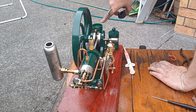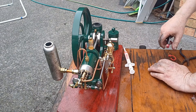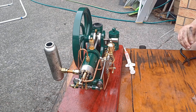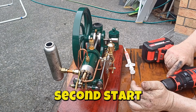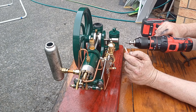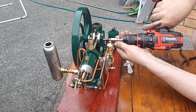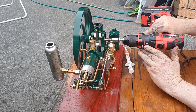The first one used to splash coolant over the top, but this one isn't — I'll still put my little coolant splash guard on. I've suitably drenched everything with oil, including the big end of the conrod, which I think is possibly the most important. I'm just going to flick up my compression lever and turn on my flow a bit. This is in fast mode because it gives us a little bit more heat to start the engine.